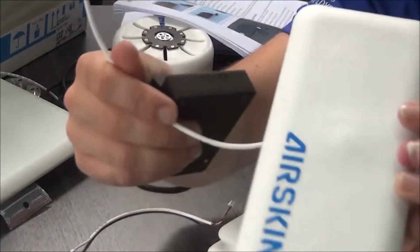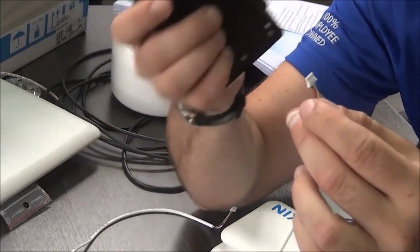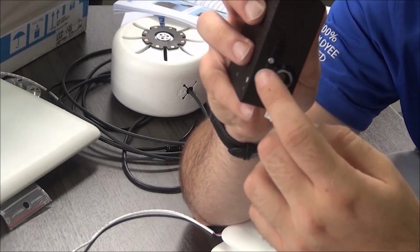If you wanted just one pad, you can take this termination here, and you can actually plug it in right here, not here, but right here. I would never really recommend that you step into a safety cage unless you have some other redundancy. When doing a setup and a test of this, I tested all of these from outside of the safety cage. I actually reached in and probed these. I would only really recommend doing this from inside of a safety cage if you had something like a dead man switch.